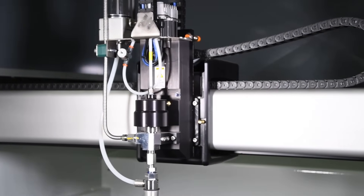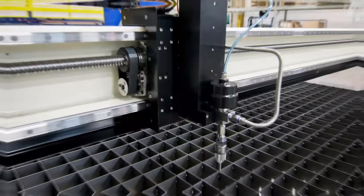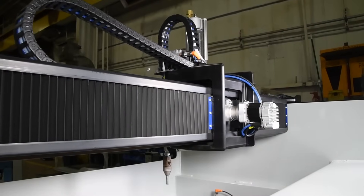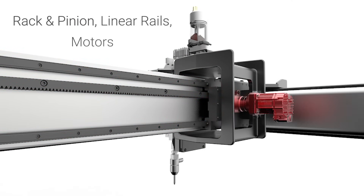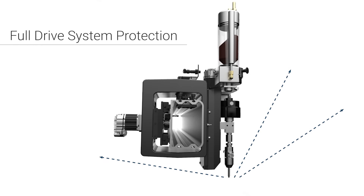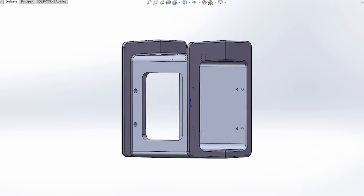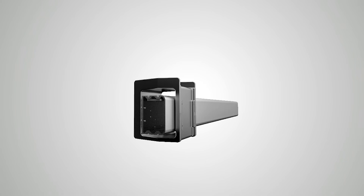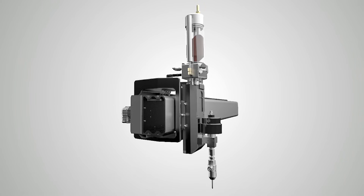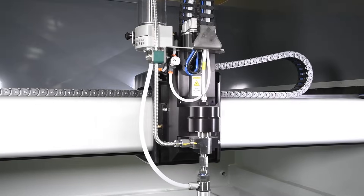Some of the most innovative features of the A-Series reside on the machine's cross beam. While virtually every water jet cutting system features a drive system mounted on the front of the cross beam, the A-Series drive is mounted on the back. By placing the rack and pinion, linear rails, and motors on the back of the gantry, the drive system is completely protected from a direct hit from the water jet cutting stream. To achieve this configuration, WardJet engineers designed a custom wraparound that slips over the cross beam. The motor is mounted to the back of the wraparound and the cutting head is mounted to the front. Precision machined out of a single piece of aluminum, the wraparound is both lightweight and rigid, allowing it to move quickly while maintaining extreme accuracies.